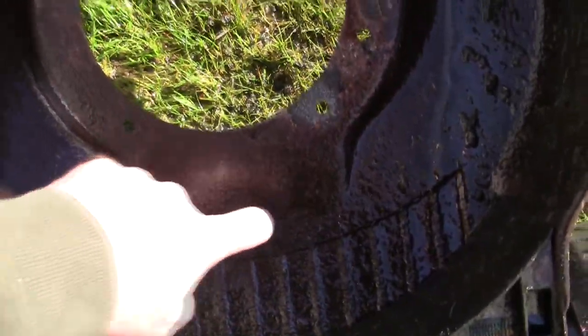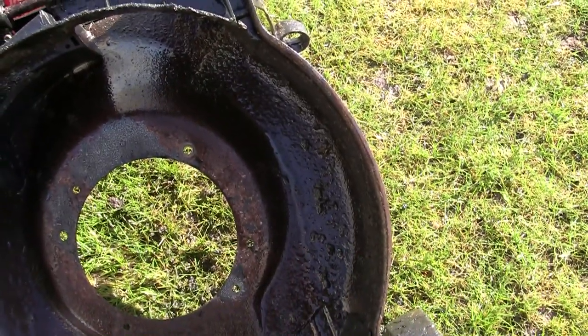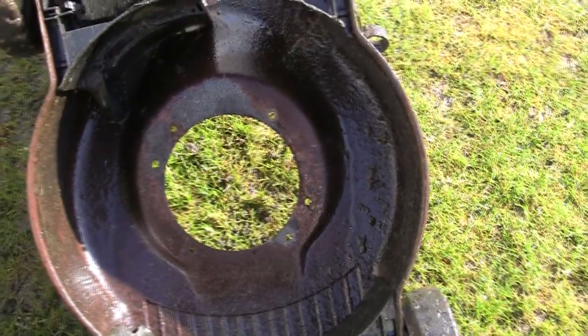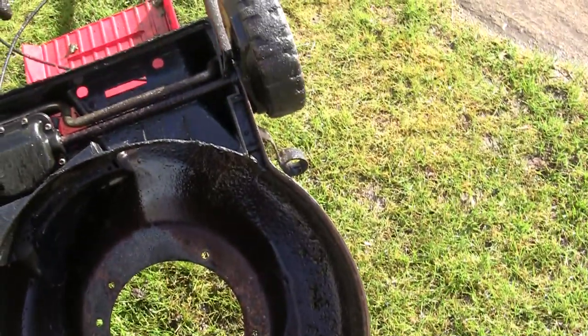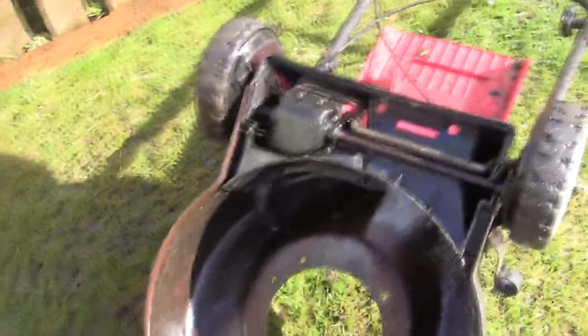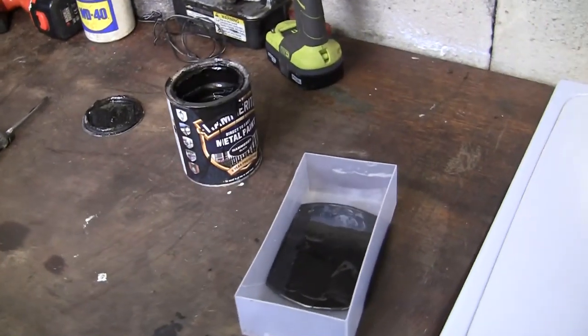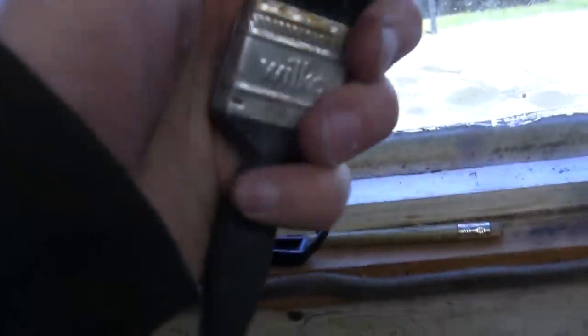Really that's all you need to do - you can see the big difference. Once this has dried off I'm just going to coat it with some paint. Any sort of old metal paint will do, but just get something on there that puts a seal between the metal and any grass that's going to stick underneath it. These decks tend to rot out in the corners - when you see any for sale that have rotted out, they've usually gone in the corners. In just a few minutes you've got the whole thing cleaned off. I'll get some of this Hammerite black and just put a bit in a tub with an old brush and apply it underneath - that's all you really need to do to protect it.